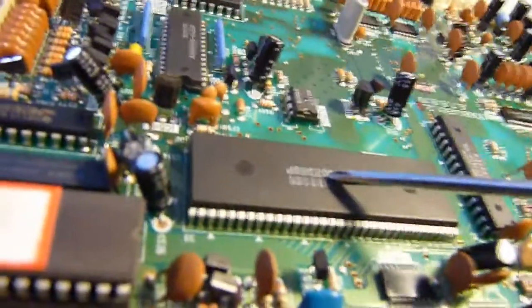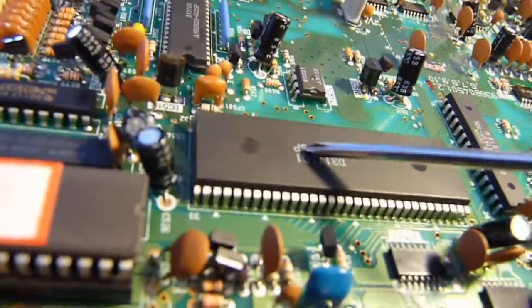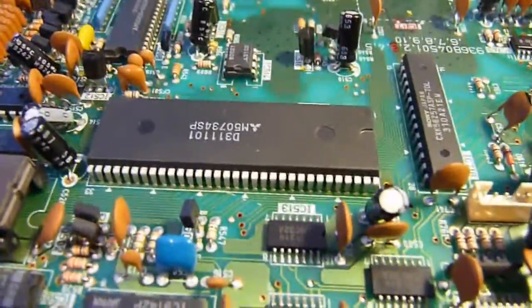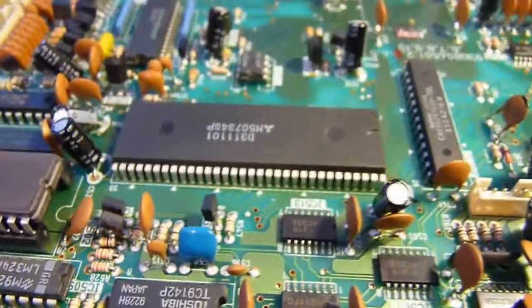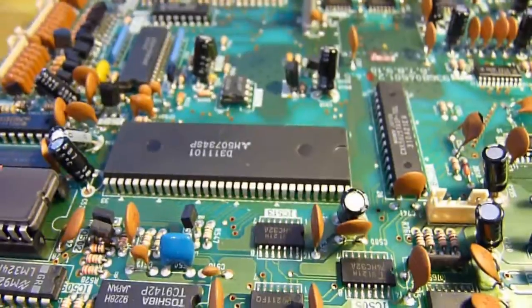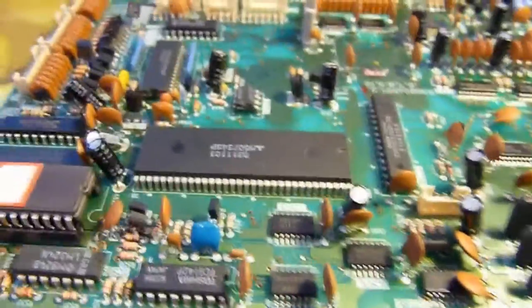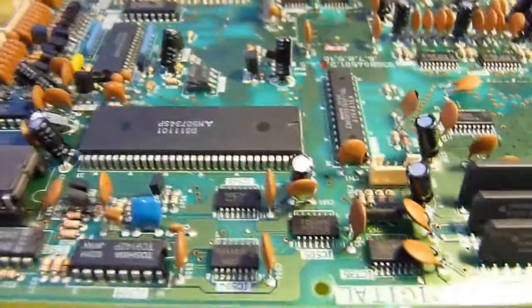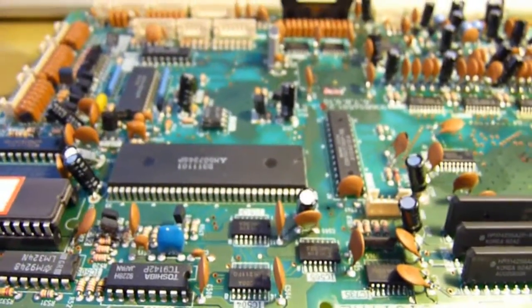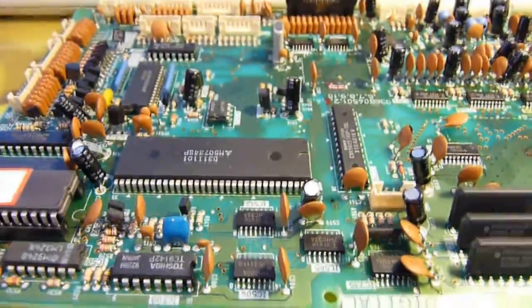This is an M50734SP, and it is a microprocessor, well, microcontroller. Only it doesn't have its own RAM and ROM built in. The wiki gives a good sort of thing, because it's basically an enhanced 6502 processor. Yay! We could probably run this on a BBC Micro. It has 24 input-output lines, 4 analog to digital converters, that's where they live for the video stuff.